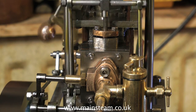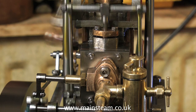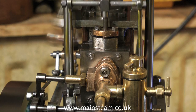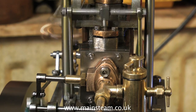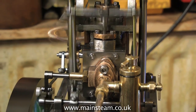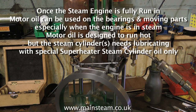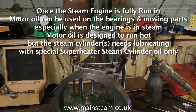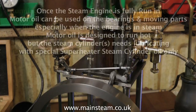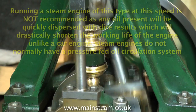Although sometimes it is good fun to open the regulator wide and watch the engine spin away. This engine has a governor but the linkage is quite ineffective — it does not shut off the steam properly, or in this case compressed air. An engine of this type going like this nearly dances off the bench. Usually when I've finished rebuilding an engine, I run it at warp speed for a few seconds — I don't recommend this — but it does show you the engine is in good order; if anything was wrong, it would really show up at this speed. Don't do this for a prolonged period, because the oil will be spun off by centrifugal force and you'll end up with dry bearings very quickly.